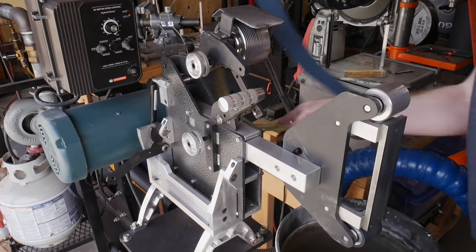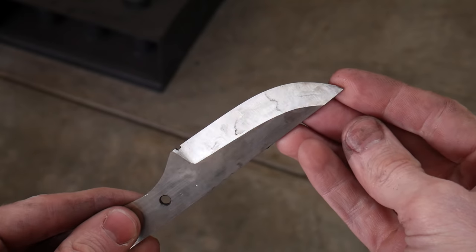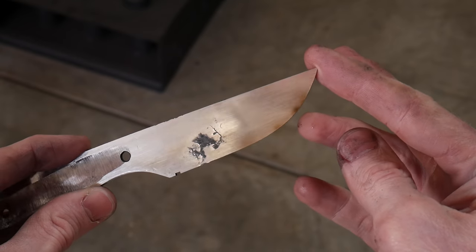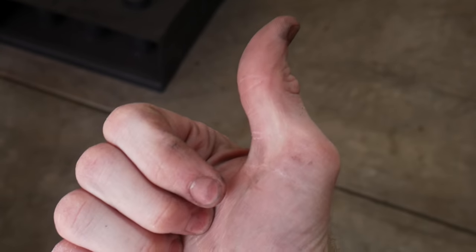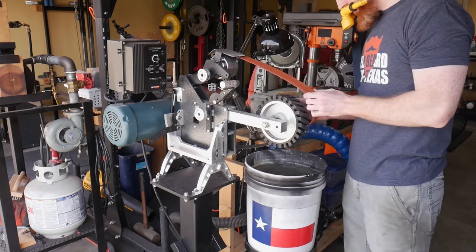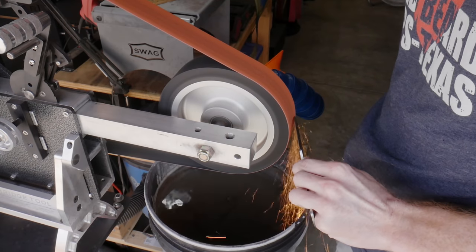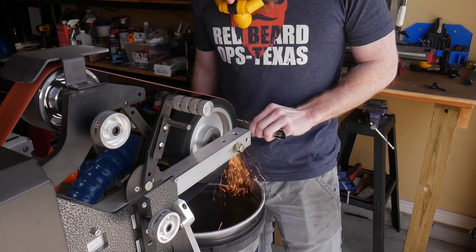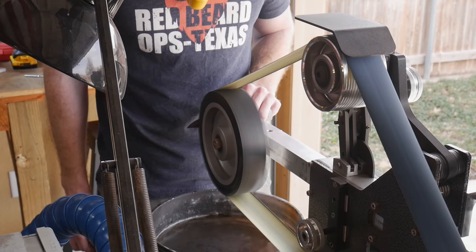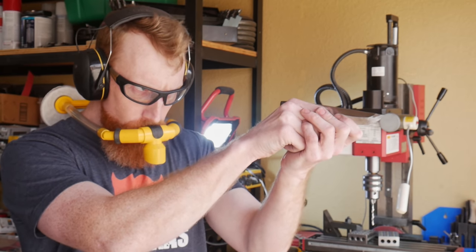Once we finish with our 60 grit diamond impregnated ceramic belt we will move on to a 220 grit diamond impregnated belt so that we can heat up the blade more efficiently and temper the rest of our edge. With the low grit belts they don't produce enough heat to properly temper this ZR-108-AL-RV80 super steel. After we have achieved a perfect flat grind on the left side of the blade we will be taking the platen out of the grinder and adding an 8-inch contact wheel to our Northridge grinder so that we can grind a hollow into the right side of the blade. I'll go into more details later on why I prefer to put a hollow on one side and a flat grind on the other side, but suffice it to say it increases the performance of the knife.